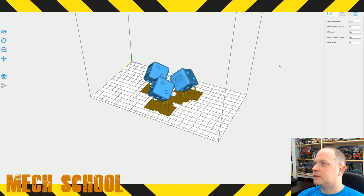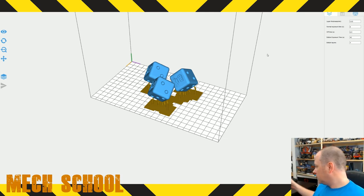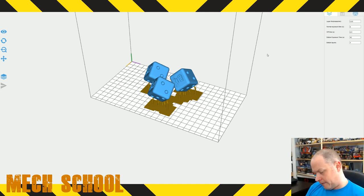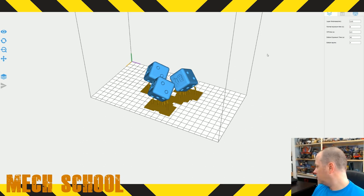Cool. We'll see how this turns out. So for resin, I'm using Monocure Rapid Clear, but I'm putting some dye in it to turn it blue. So here's my 3D Rapid photopolymer here, clear. And I picked up this set off of a website, and we've got some blue pigment. So I'm gonna mix these together and print this in blue resin.